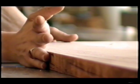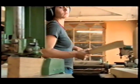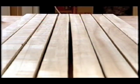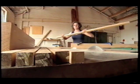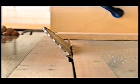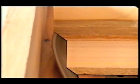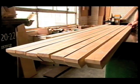What I'm after eventually is 35 by 35mm square pieces, which I'll be able to use for the main frame of the bench and for the slats at the top. So I'll take it to the bandsaw and rip it down into length. I've dressed it all round so it's got four clean faces, and I've picked through and chosen the pieces I want to be the top of the bench, and I'm just about ready to dock it to length. The square pieces are docked to length on the table saw. I'm going to be doing some shaping of the slats for the top to take off the angle on the edge and ends to give that 45-degree bevel. It gives a piece of lightness without compromising on the strength of the slats — visually your eye is only going to read the 10mm lip which I leave, so it's going to look like the top itself is only 10mm thick.